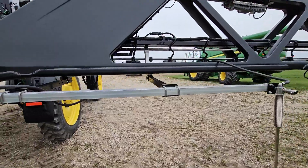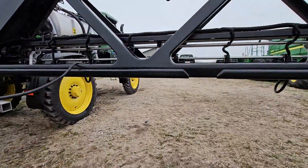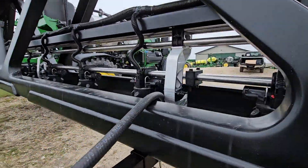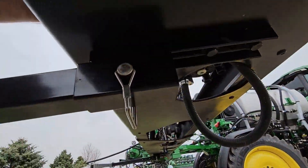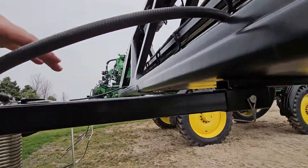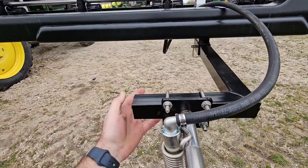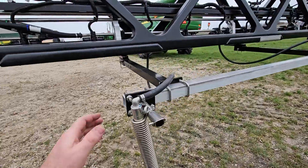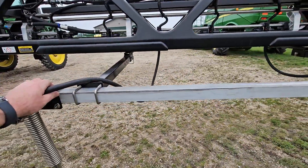So that's positions two and three. Position four is the same mount — we're mounting right below the wet boom mount with the C-channel receiver. This is a 9x18: 18 out, 9 over. Just lining it up, eyeballing it with your nozzle body is good enough — it is going to follow the row. So this right here is going to be positions five and six.